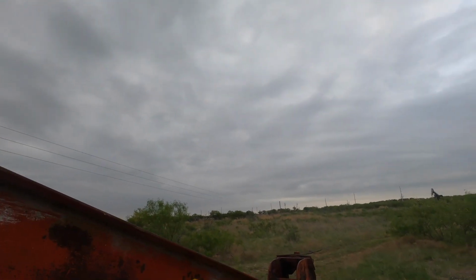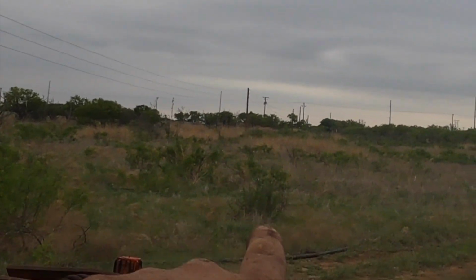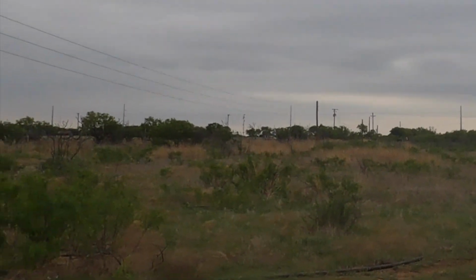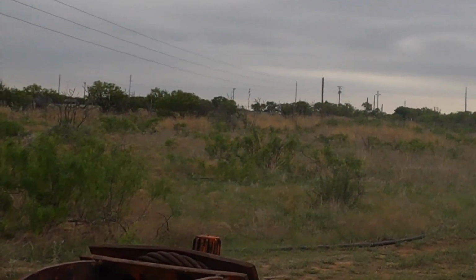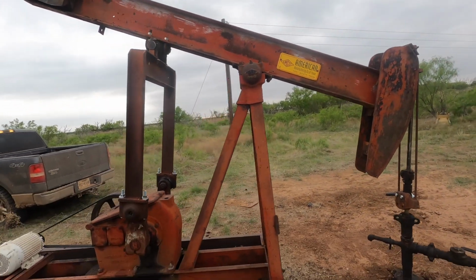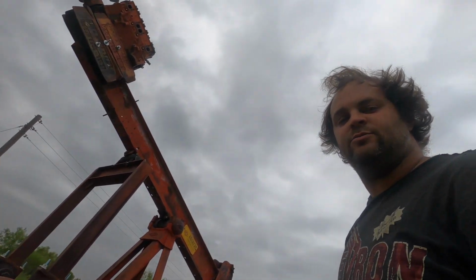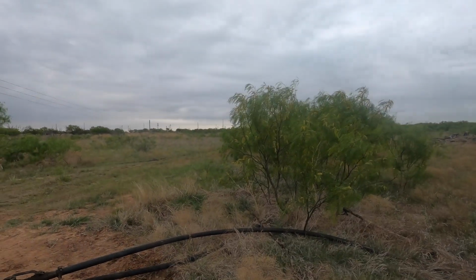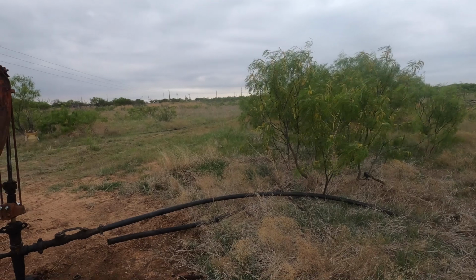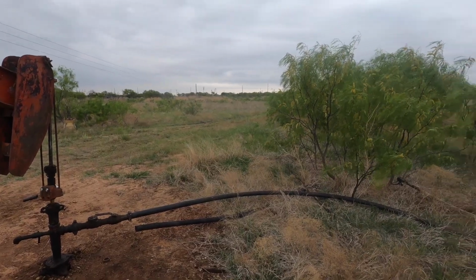Now, like I mentioned earlier, you can see that yellow unit that's right over there somewhere. It's black with a yellow head. That's the one that came off this. Same weight, same unit, same everything. It's identical to this one, other than it's painted black. Same model. And I was guessing that I probably needed 800 to 1,000 pounds of weight. So I went over there and measured those weights, and they're 24 by 20 by an inch thick. You do the math, that comes out to 125 pounds each, times 6 is 750 pounds. So I feel like my guess was relatively close. Now that wasn't enough. It was short.